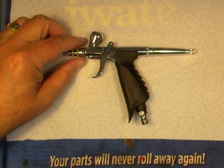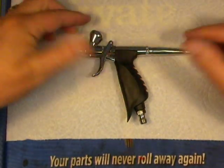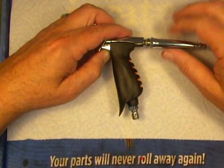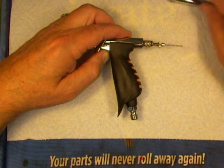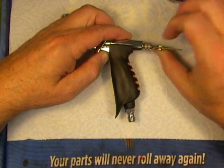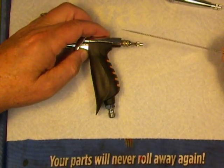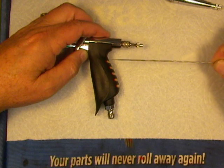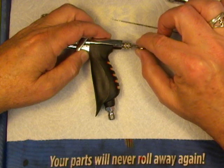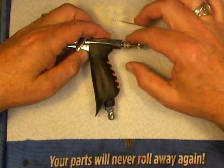These are a little different than standard trigger airbrushes, but let's get started. We'll do the easy thing first. Unscrew the handle — easy enough. Next, we will unscrew the needle chucking nut and pull out the needle. There's a bit of crud there. When pulling out the needle, if it made the whole needle action assembly move, then you know the needle is pretty crudded up.